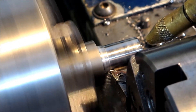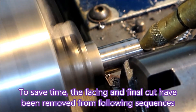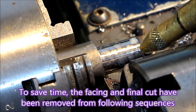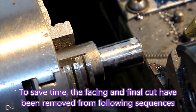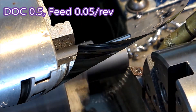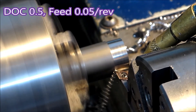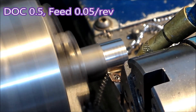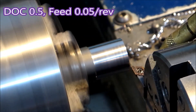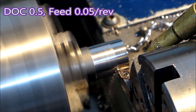If I've got a lot of parts to make, I'll use two finishing inserts — one to do the roughing, and when it wears down a bit it doesn't matter too much because the size isn't critical while you're roughing. Then for the finishing pass you use a second tool with another insert which only does the final pass, so when you're making a lot of parts you can actually hold the size you want without wearing out the one tool by doing everything with it. This is the middle of that chart: 0.5 depth of cut by 0.05 mm/rev, and the chips are coming off quite nicely — the finish is not bad either.